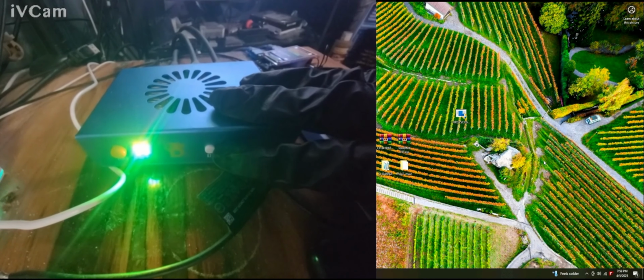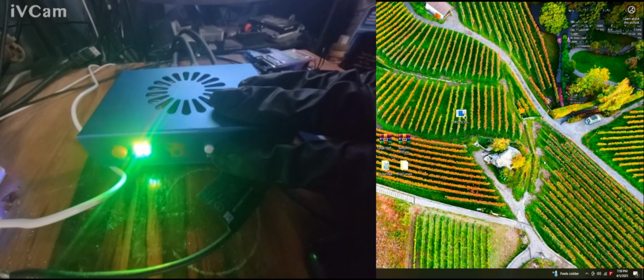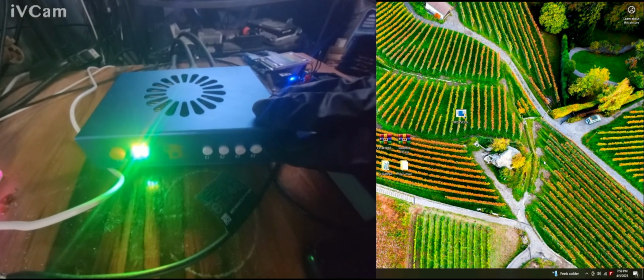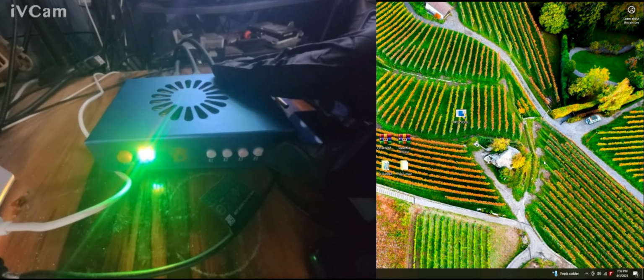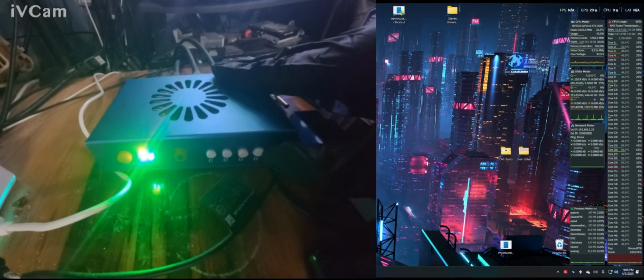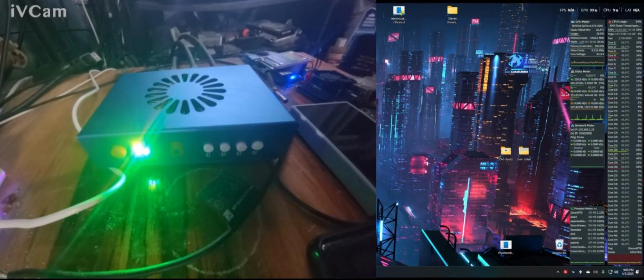K2 is going to change your black level, and I will demonstrate what that looks like now. You can kind of see how everything that is black is being transparent. K3 will reset K2, or you can just press K2 20 times for each level. And lastly, the only button that you will ever press on the fuser, K4. K4 will turn on and off the D2 light, representing if it is fusing or is overlaying.